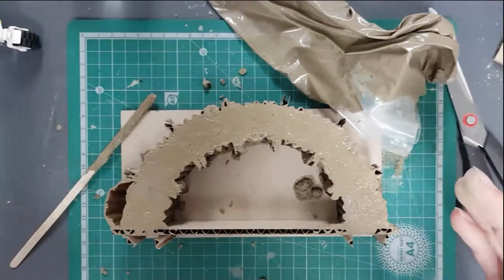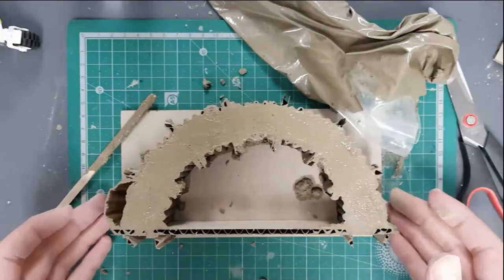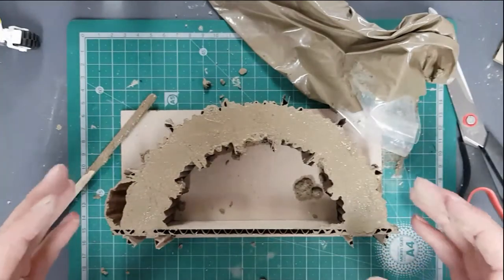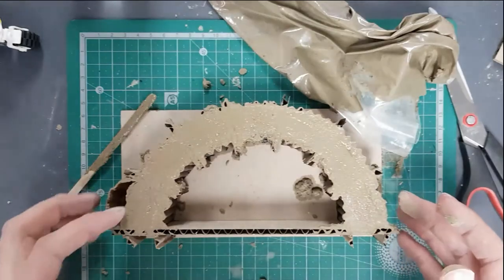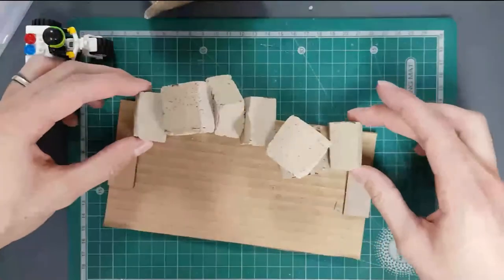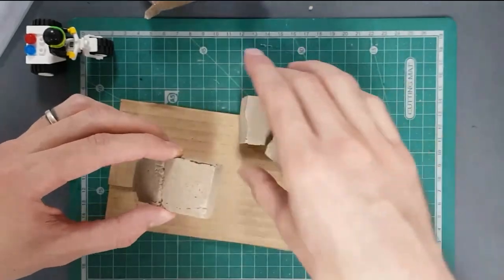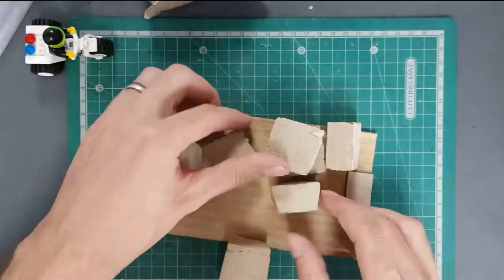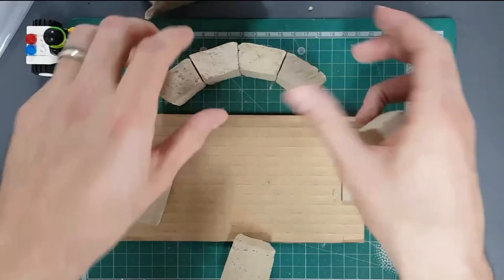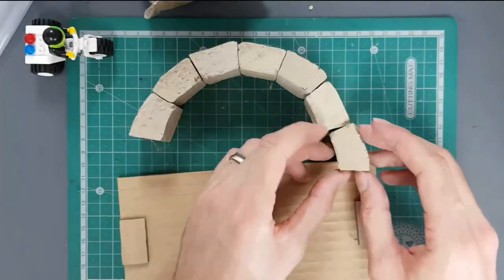When you're done, ideally put this into a plastic bag to stop the water from evaporating too quickly. Leave it for at least 24 hours so it can get nice and strong and doesn't dry out too quickly and lose its strength. We'll unmold it in a few days to see whether our mold has made a suitable strength arch bridge. I hope you had fun — in the next scene I'll show you the final product again, and then we'll do some questions and research project work in the upcoming lessons.